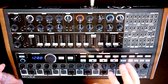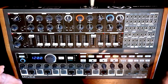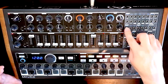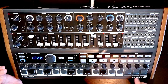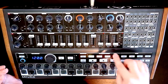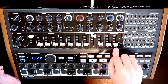So how do we emulate a low-pass gate on the Mini Brute 2S? All we need to do is make sure that our amp VCA — this section here in the patch bay — is being controlled by the same modulation source as our filter FM control, or we could do it with the cutoff; either would work. As it happens on the Mini Brute 2S, our amplitude is by default controlled by the AD envelope here, which is either a two-stage or three-stage envelope — which is good, because that's kind of what we have on a Music Easel as well.